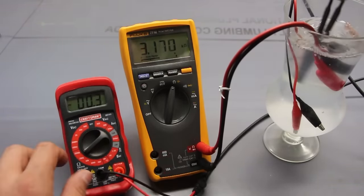Does this close a circuit? Does it open a circuit? How would you know? Well, you could spend probably 10, 15 minutes looking it up. Here they have potentially a model number that may help, but more often than not, most likely you'll have these switches and you won't know exactly what the connections are. One of the ways that you can do this is to simply set it to ohms, and you just start probing from a common point and see. So let's keep it up and let's test it out.